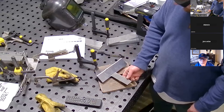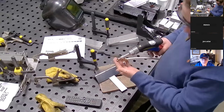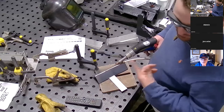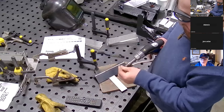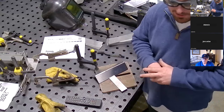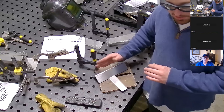Widening the wobble will use the same amount of wire, because the way this functions is the wire comes out from below and when it's welding it's actually pushing the gun back. It's not like a MIG where you're feeding a million feet a second — you use very little wire with this. My spools of wire typically last me years. Widening will help grab more material from the pieces themselves so I'll be able to include more base material and get a bigger radius to the overall weld.